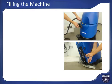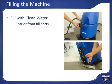The CA-60 has two fill port locations. One is located on the front of the machine and allows filling by either a hose or a bucket. The second is located at the back of the machine and doubles as the solution tank level tube — connecting a hose to the top of the level tube is the other filling option. Fill the machine with clean water; the solution level sight tube on the rear can let you know when you are close to full to prevent an overflow. Fill to the mark on the rotomolded tank. Hot water cleans more effectively, but the temperature should not exceed 130°F (54°C).